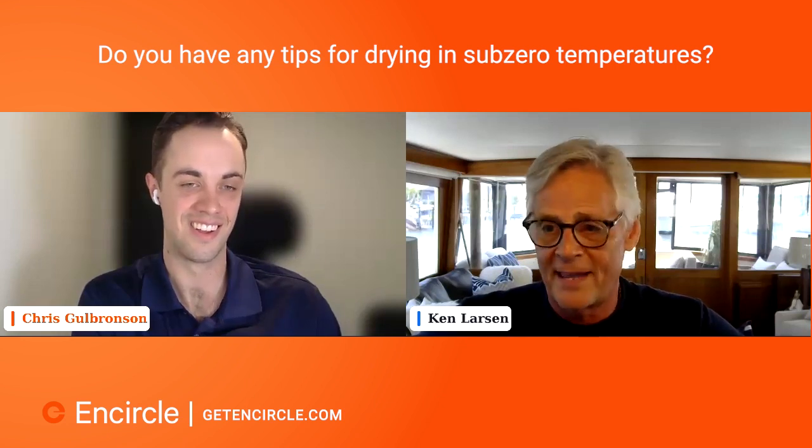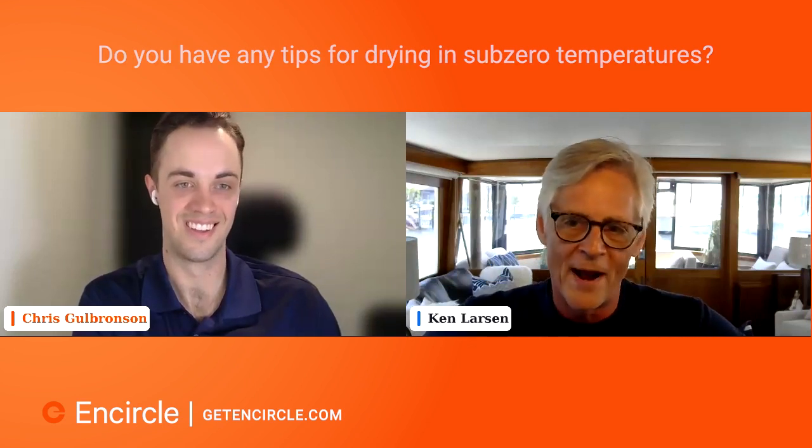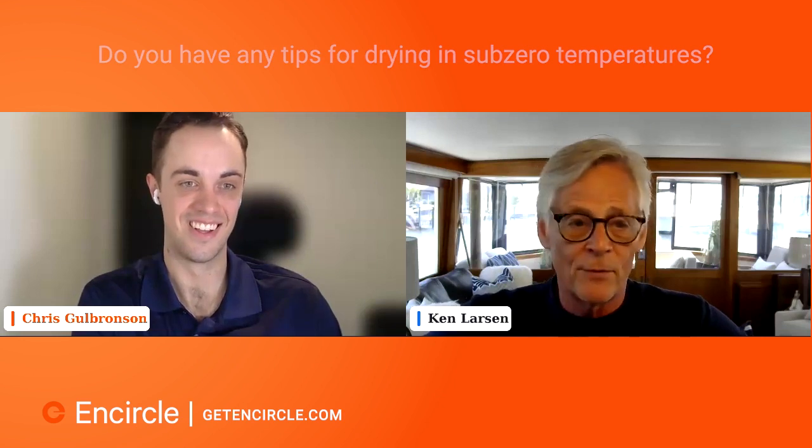If you think it's tough to dry in a cold Canadian environment, try drying something down in Houston, Texas or Miami, Florida. It's not uncommon outside here in Florida to have 160, 170, or even 180 grains per pound. When you open the door, that humidity just floods into the house and is constantly trying to get in. That's a difficult drying chamber — it might be hot, but it is brutally tough to dry things in a humid outdoor environment.